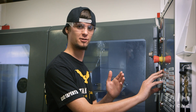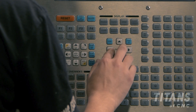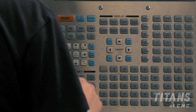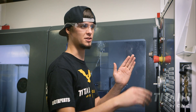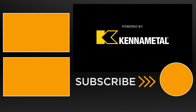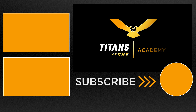Now that our edge finder has stepped out of center line, I'm ready to set our X. I'm going to go over to my X-axis tab and hit part zero set. Then I'm going to take my tip diameter, divide it by two, and add it to the position the machine has just set. And that's how you manually zero your work offsets. Thank you very much.